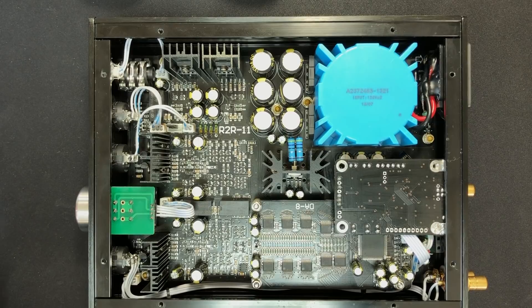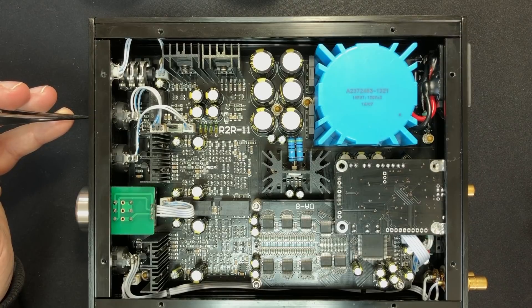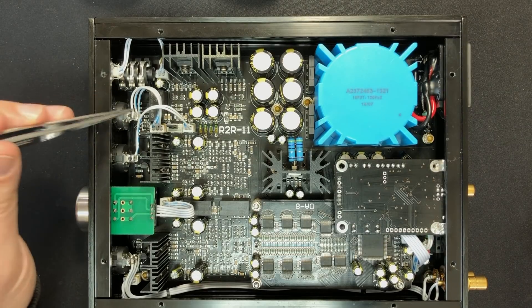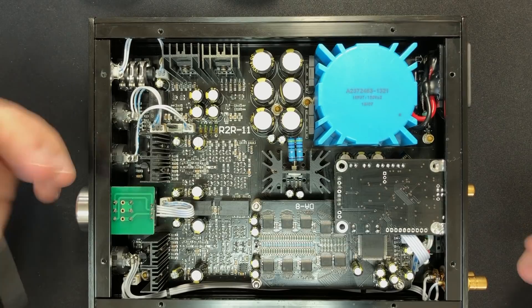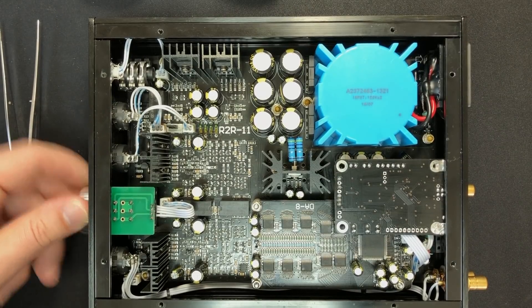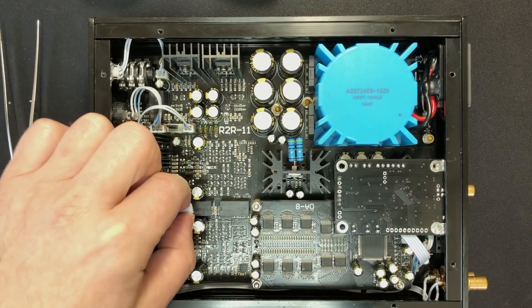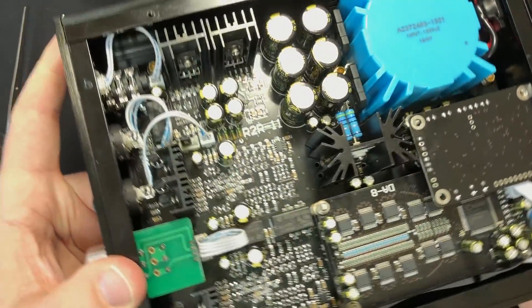If you want the sound a little warmer, there are a couple of jumpers which will engage a couple of capacitors to soften the sound slightly. There's also another feature: the pre-amp switch and DAC switch at the front — the DAC switch will still be in pre-amp mode by default, to stop someone accidentally blowing out their speakers. To actually use it in pure DAC mode, without just turning the volume to max to bypass the volume, you have to pull out a jumper and switch it over one notch. That engages a relay and switches it to pure DAC mode. The volume control is actually an Alps potentiometer, full-size, mounted underneath the board and connected via a ribbon cable.